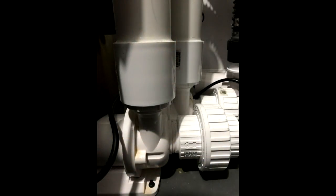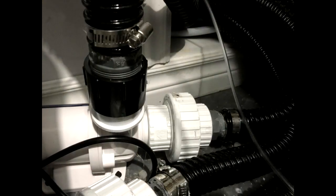There are certainly different ways to plumb the Vectra. Joey Mullen, the king of DIY, was kind enough to shoot me some photos of how he plumbed his pumps. Joey's using the Vectra M1 pump externally, but the same method he applied can be used to plumb the pump internally or submersed underwater. Joey hard plumbed the M1 pumps using a 2-inch adapter to a 1.5-inch PVC run. He also soft plumbed other M1 pumps using the same size adapters as the one he used to hard plumb, as shown here. Thank you very much, Joey, for the pictures and the advice.